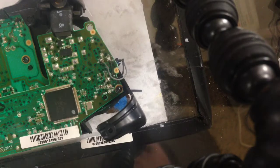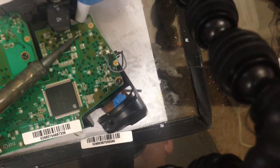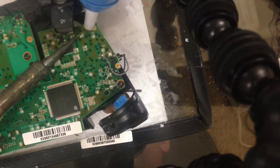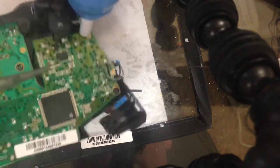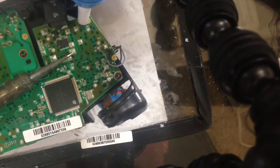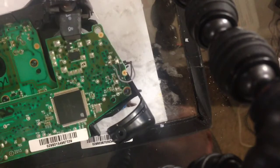I'm going to show you how this works on one — I'll probably have to turn the video off because I can't work around the camera too well. Get your soldering iron on the solder until it warms up. Once that solder turns molten, put your sucker on there and suck it out. See how that has an exposed pin in there?